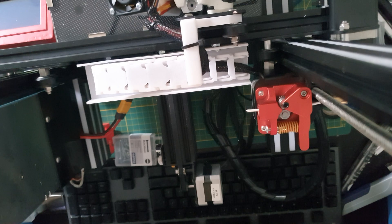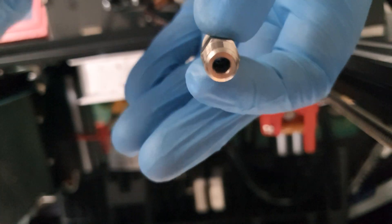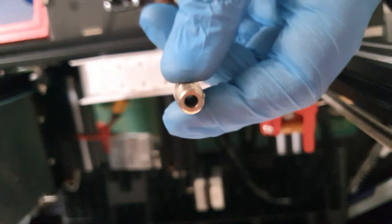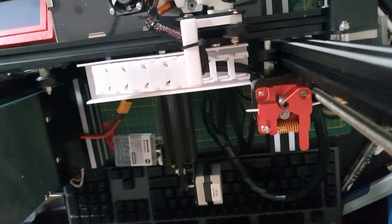For the smaller diameter couplers, as long as you push down so the teeth aren't engaging and you drill through, it should not damage the teeth - they should still function as intended. There are two versions of the coupler: the flush one and the indented one. Inside the indented one there's another diameter flush with the tubing. You need the flush ones - just a straight hole. You could also use a bolt that you drill through, but you want a fitting that is flush with your tubing.